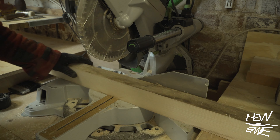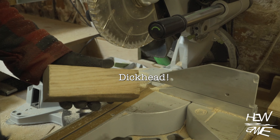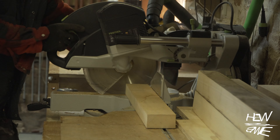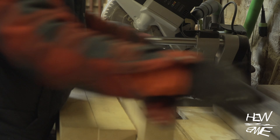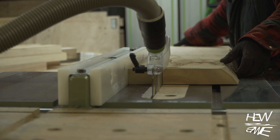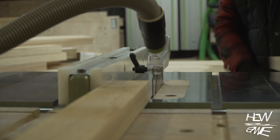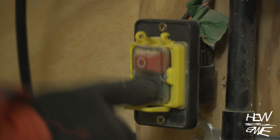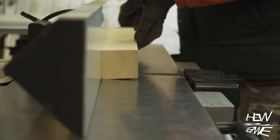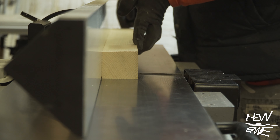Like checks and shakes in the end of the boards — look, just like today. That's not usable. Fair enough for pen blanks or whatever, but making furniture you need to allow for it. Just the sawing, ripping through that bit of wood, is 3.2mm gone in dust. And then look, we're probably losing nearly 4mm planing that down to square. That goes on and on. Right here at the end of the board — do you see that?